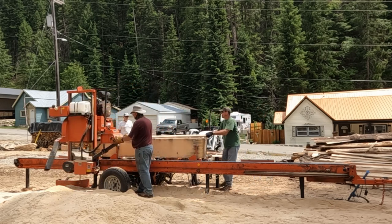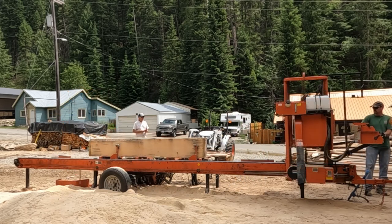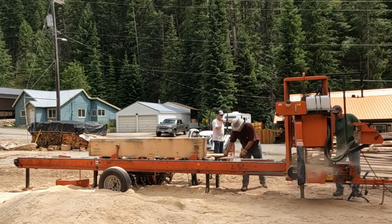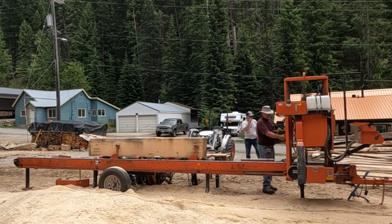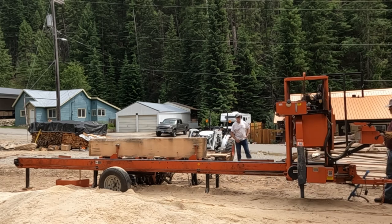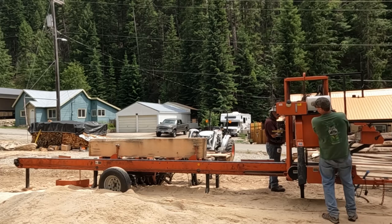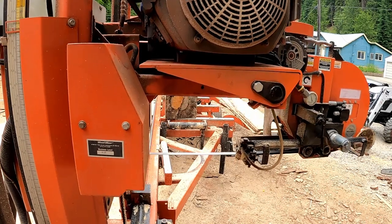I'm just checking the top of the log — it kind of feels like we're not cutting right — so I run my hand across it, and sure enough it just wasn't cutting perfectly flat. When you walk beside the log the way I do with this mill, you can really see what's going on as you're cutting. If the previous cut isn't perfectly flat, it's time to change the band out. Wood-Mizer says regardless of the band or mill, these bands are really only designed to run about two hours in the wood. They get hot, they start to lose their sharpness, and it's a good idea to swap them out.